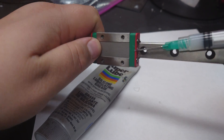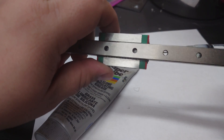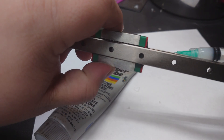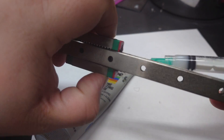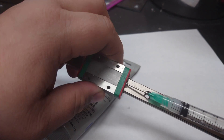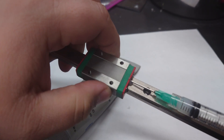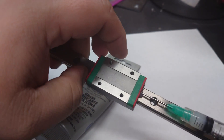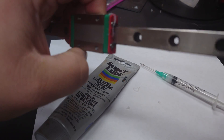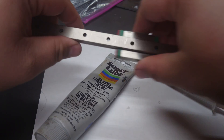So on one side I'm going to be plunging the grease in, and I want to see if we can get a visual of the grease going in. It's a little cumbersome. We are plunging grease in, which is good. If you use the needle to push the rail as you're plunging it in, it should get it to move in, and then you just move it around. Don't forget the other side also has a grease port.